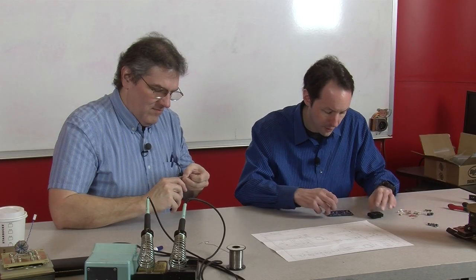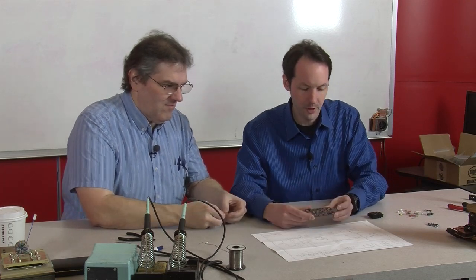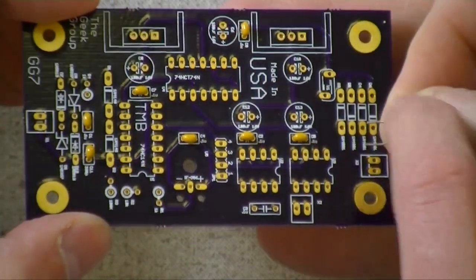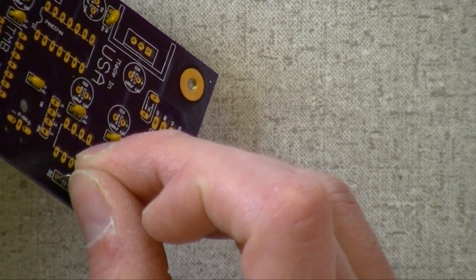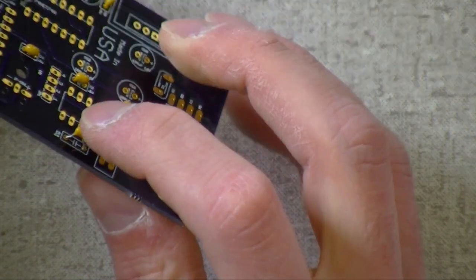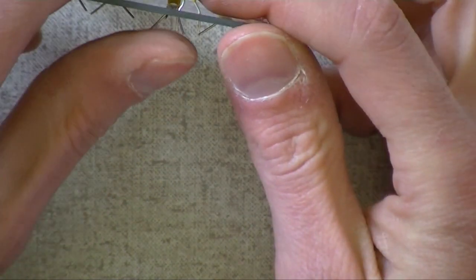It's kind of a trip having to find all these because I've never done this one before. I don't know where anything is. Okay, I have found all of them. You got six? Okay, well, I ran out of capacitors. Yeah, so here's number seven, and I got the leads a little farther apart. It's going to go right there, in that weird hole. Like I said, it's a little larger to accommodate a slightly larger cap if you need it. But for our purposes, we start out with this. It goes right there, just up a little bit. And splay the legs a little on the bottom so it doesn't fall out on you.